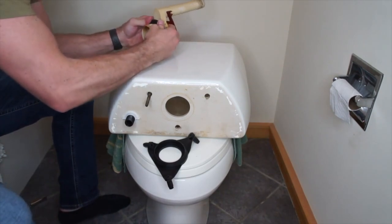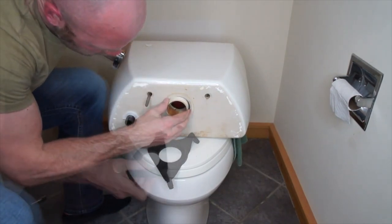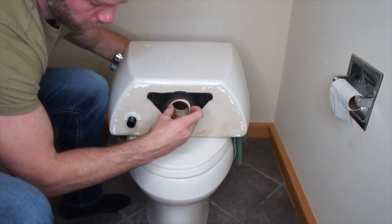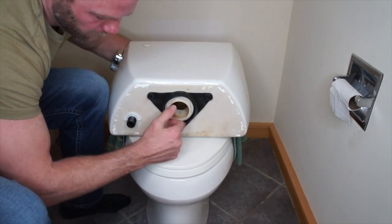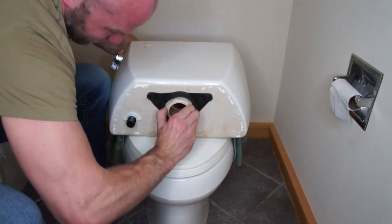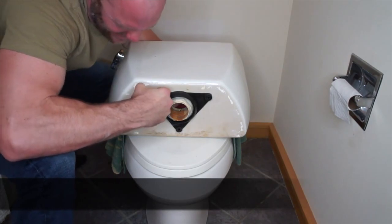We'll replace that seal with the new top seal. With the new seal shoved all the way onto the overflow tube, we can slide the whole thing back in where it came from. And we're ready to put the new seal on the bottom. With these triangle-shaped seals, they only go one way — one of the points is shorter than the other and that's the one that goes to the back. You'll shove all the points into the bolt holes, and then you'll need that slip ring. Put the slip ring on, then put the nut on — finger tight should be good enough, but get it as tight as you can with your hands. Now shove all the bolts back through the holes. This is kind of the hard part — you have to shove them through that rubber seal — it takes a little effort but it's not too bad.